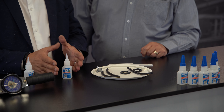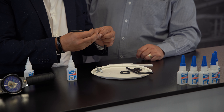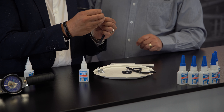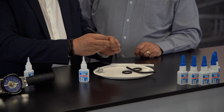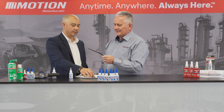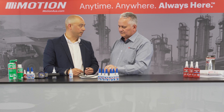So we've bonded plastic, and we've got rubber here as well. We typically use 406 to make customised O-rings — I've made a lot of O-rings over my time. The lesson for me is possibly the same: maybe using just a little bit too much product. So less is more again — one small drop, that's a very small drop. Bring the two together for five seconds and you're good to go. Going nowhere! You can see even with that O-ring we've done previously, try and break that — she's good. You will actually break the substrate before you break the bond line. Incredible.